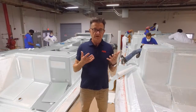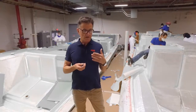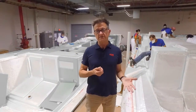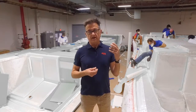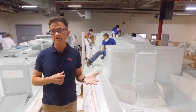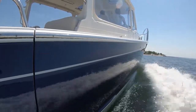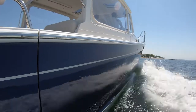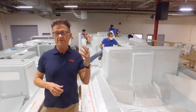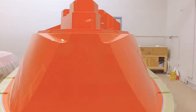This is a good example of how moving from open molding and even vinyl ester infusion, we're able to achieve about a 30% weight saving by using infusion epoxy and a structural fabric like a quadraxial without the chopped mat on the back. About a 30% reduction in final weight is something you can't achieve any other way — there's no way to take that weight out of the boat without making a compromise to stiffness and strength.